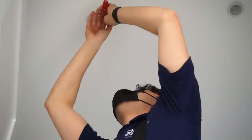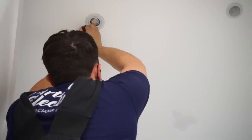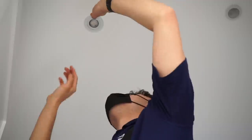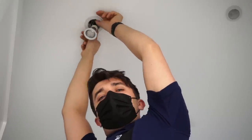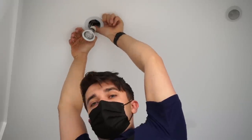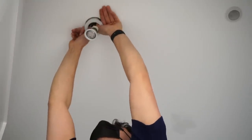I'll show you a tip for taking out downlighters, especially when they've been painted in slightly like here, because ruining the ceiling is never good. No one wants to have the sparky round and then have to get the decorators in. I get my Stanley blade and carefully cut around it. There are two problems: the sparky mousetrap where the springs get your fingers, and damaging the plasterboard. I twist them, drop them, and actually support the plasterboard with my fingers while pulling it out with my thumbs, then look where the springs are and support the plasterboard.